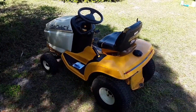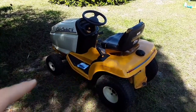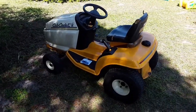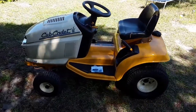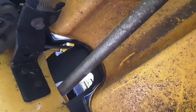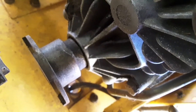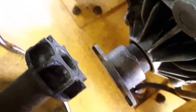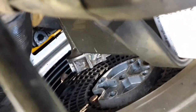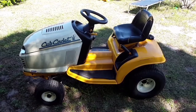There are other videos on YouTube showing how to do the drive kit installation, but they do it by taking the whole back end off the tractor and removing the driveshaft. I'm actually going to do it with the driveshaft underneath because I didn't want to take the whole back end off. As you can see the driveshaft is still under here. There's the back end where it connects to the rear end, you can see all the slots where the barrels go and where the coupler fits over it. Down there is where the driveshaft connects to the motor in the front.